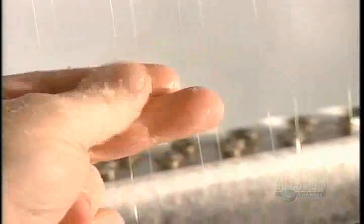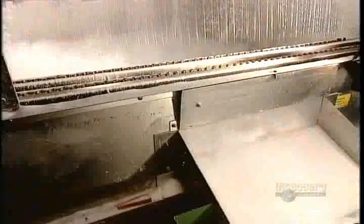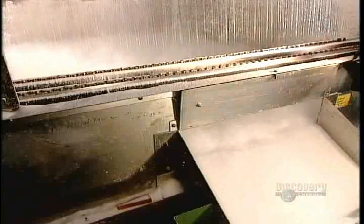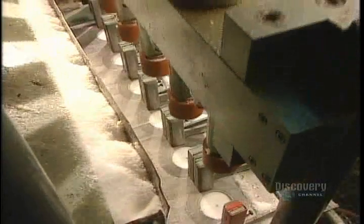The hot paraffin travels from the holding tank to a set of sprinklers inside a 6-meter-high refrigerated chamber. The sprinklers shoot the wax upwards into the cold air. Like falling precipitation transforming into snowflakes, the wax droplets transform into wax flakes. They land at the base of the chamber, then travel to a hydraulic press.